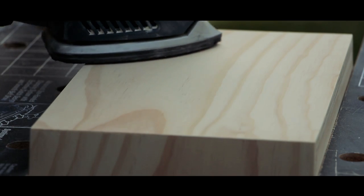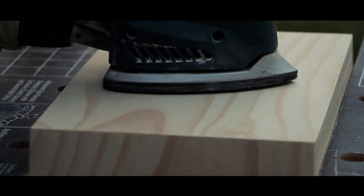After that I waited a day to let the glue dry, then began sanding. The whole sanding process took about six hours, but you don't have to go that overkill — I just wanted it nice and smooth. My grit progression was 50, then 80, then straight to 220 because I didn't have any 120. Once all the sanding was done I realized I forgot to put a hole in the backplate.